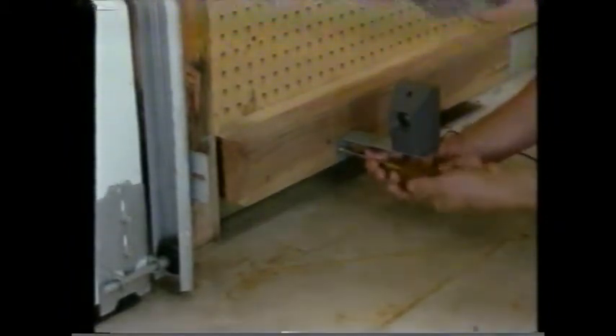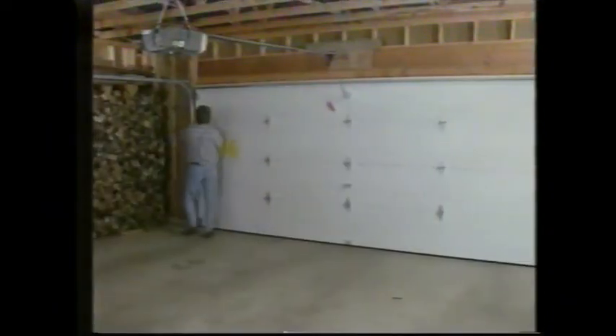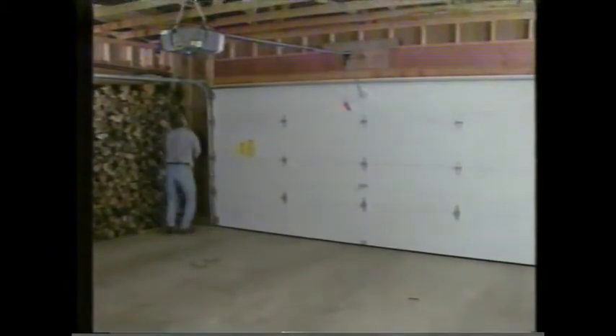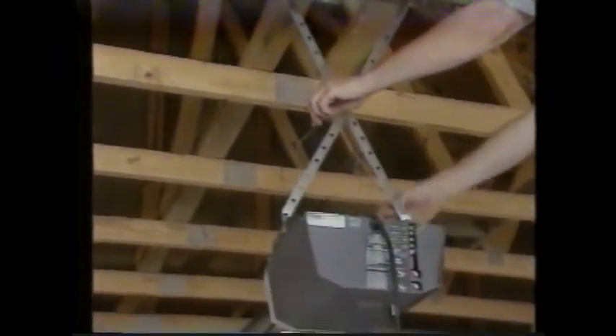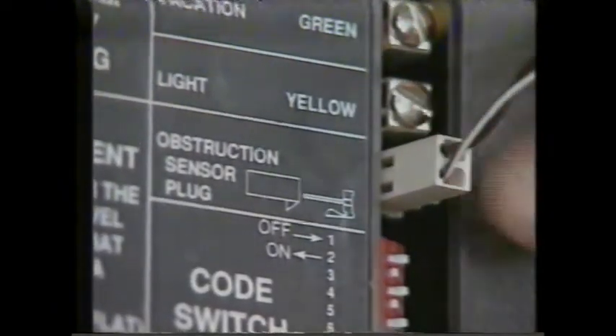In our case, the receiving unit goes on that side. First, attach the sending and receiving units to the brackets with the screws provided — just tighten them by hand for now. Mount the receiving unit to the wall 2 to 4 inches above the floor, and 12 inches inside the door opening if possible. Uncoil the wire and run it up the wall, across the top of the opening, and down the other side of the wall — be sure the wire is out of the path of the garage door. Attach it temporarily with the staples provided. Mount the sending unit the same way, only one inch higher. The units should point toward each other and not have anything in their path. Then route the remaining wire up and across the ceiling and down to the power unit, and carefully plug the polarized connector onto the receptor at the back of the power unit.